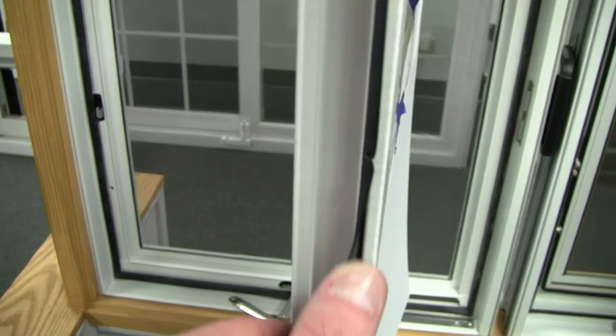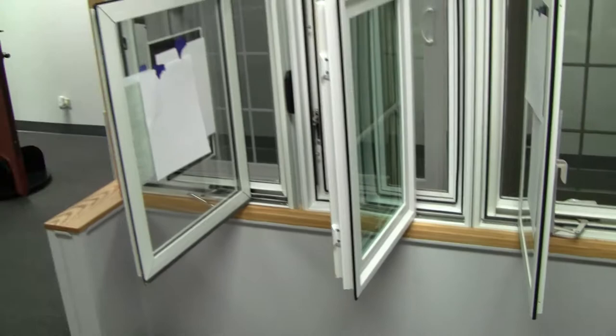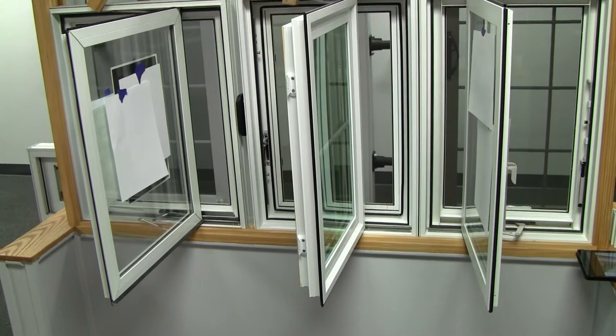So there are big differences in these windows. The ones on the ends only have double paned glass, and that's going to severely limit your performance ratings. When you walk into a room and it's too hot, too cold, too noisy, or there's too much fading of the floor or back of the couch, look at the window — about 90% of that is the window. So if you cannot do triple paned glass as an option, it's going to affect 90% of the comfort level in that room.